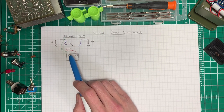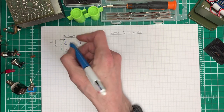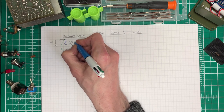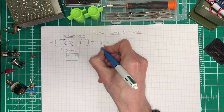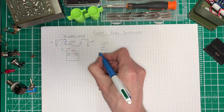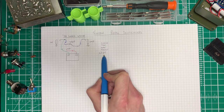You can see that in 1976 this is the way it was wired, and you'll find that kind of switching in most of those old vintage pedals. So next let's look at how we can add a pole to our switch, because this is a single pole dual throw - SPDT switch. When you see a switch advertised as SPDT, this is what they're talking about.